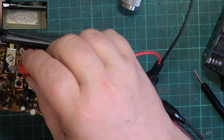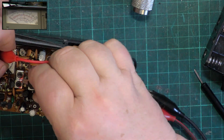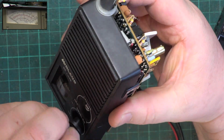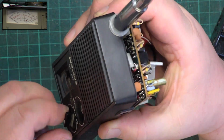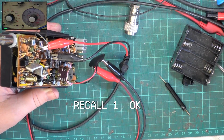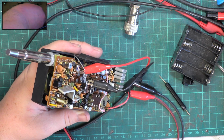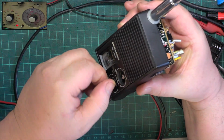We may as well go back onto this point and just look at the squelch. So we've put the squelch to full, and now we'll advance the signal generator. So 3 microvolts, 10 microvolts, 30 microvolts. Squelch is coming in on full at 10 microvolts, and now we'll check it for squelch sensitivity, parking the signal generator at 0.3 of a microvolt. So it's a threshold.